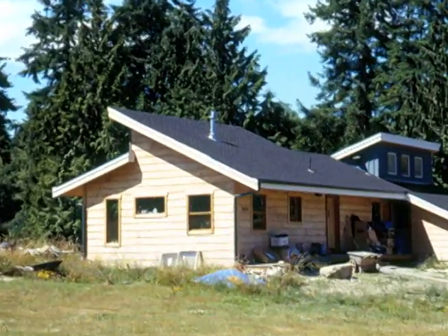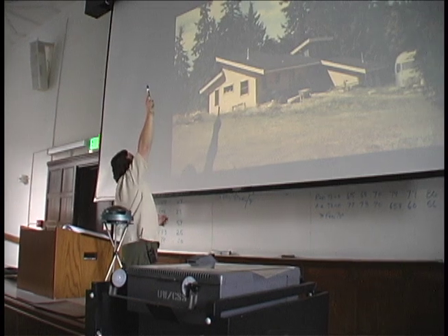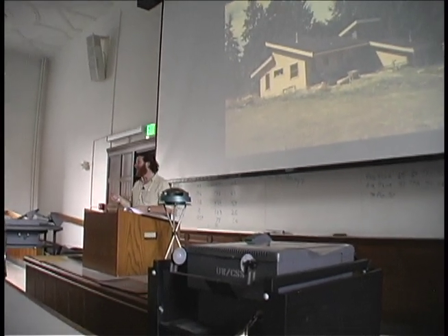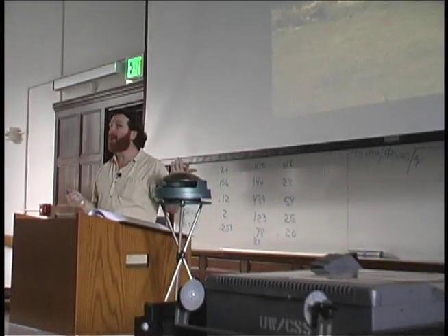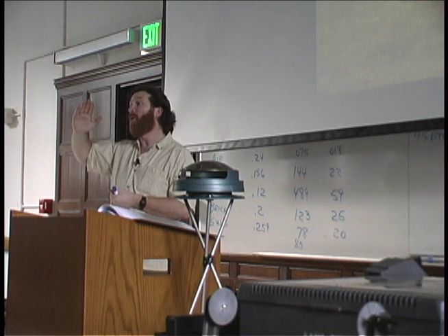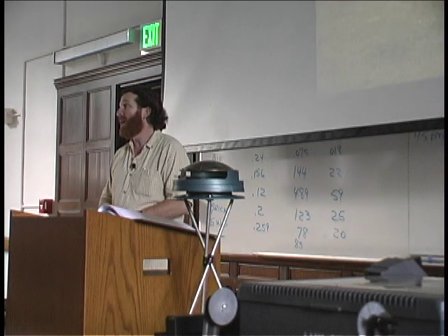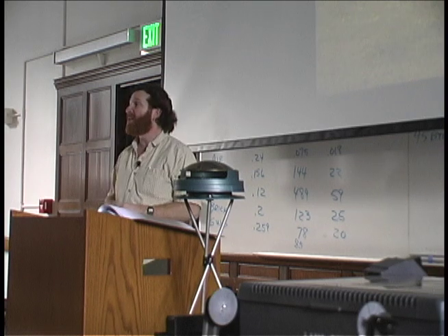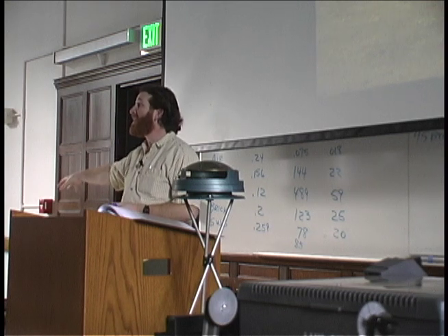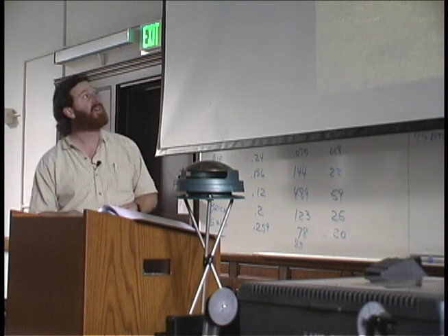This shows the side — this is the west side, I had these windows sized a little bit smaller. You can see right above there is where the beam was, and then there's the clerestory wall. The beautiful thing about a clerestory as opposed to a skylight: skylights will gain a ton of heat in the summertime and lose a ton in the wintertime. I really like clerestories better because a clerestory is a vertical window — you can make it open, like an awning window that hinges at the top. Even if you forget to close it and it rains, you're not going to get water in your house. An overhang will stop the sun from coming in during the summertime. Clerestories also give you natural light and ventilation, light and solar gain to north-facing rooms, and privacy. I think they look kind of cool — it's a modern look.